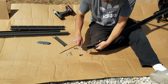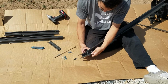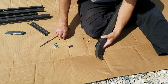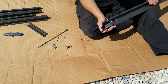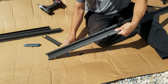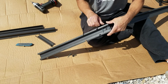Anyways, you attach a connector to your truss gutter channels. It's going to be a regular truss gutter channel that I'm attaching with the long screws, machine screws, as you see there. With an end cap on, they label it ADK, with an ADK nut on the end of it, both sides, just like the others. And then you're going to attach a shorter channel called a truss brace. Well, no, that's actually not the truss brace, it's the short gutter channel.